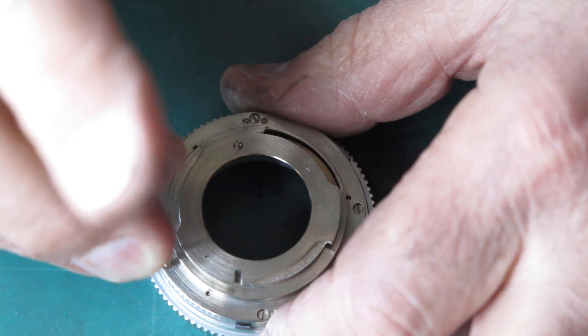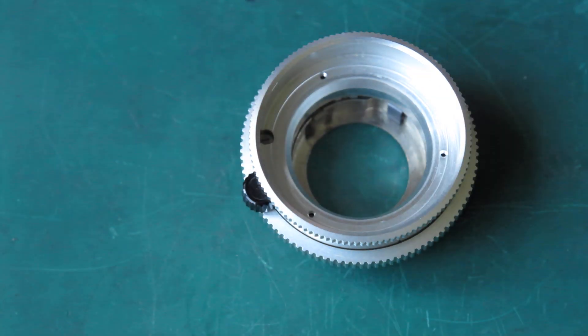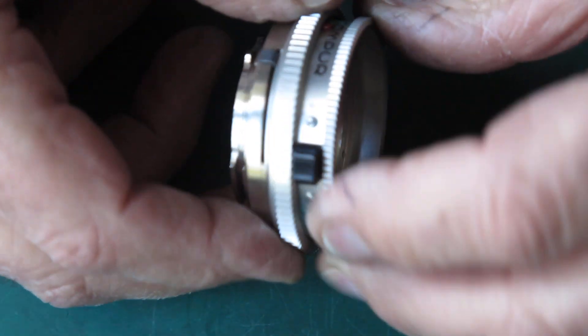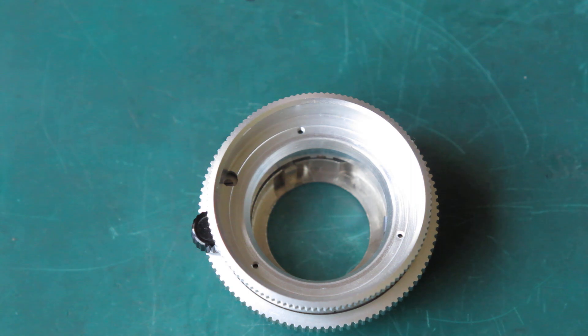That's held together firmly now. I'll check this — making sure my focus is smooth, no undue noises, no roughness, the lever that moves the diaphragm blades is free and moves smoothly, and this one moves the depth of field pointers smoothly — they drop back to their rest position nicely. That's all looking very good, so I can put the last two screws in position. All four screws are in — that's our lens body done and ready to go. Lens capsule next.